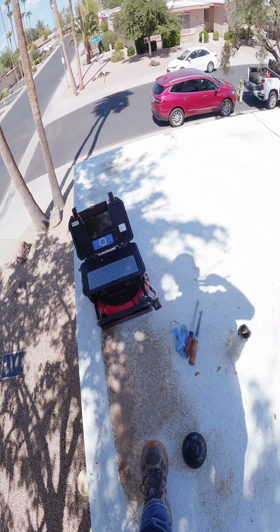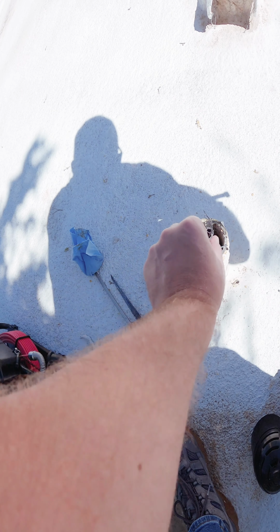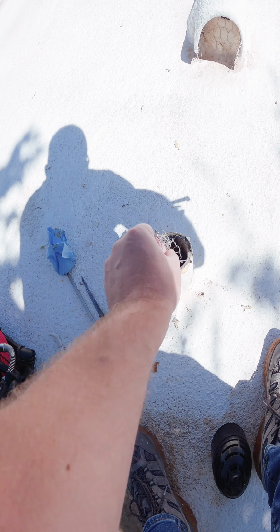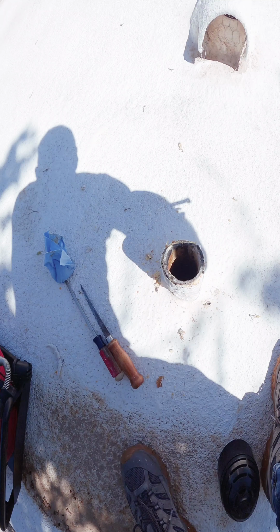So performing my sewer cam today, I had to go down in this vent stack. Why? Because the main vent stack over there was plugged by this lovely stuff that goes down into these drains, vent stacks. A lot of homeowners like to put this wire mesh in here just to prevent rats from getting down into these pipes. And the problem is, if this thing were to let go, or to go down into the drain system, it could cause some plugs, cause some clogs in your system.